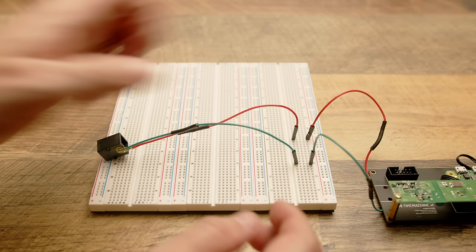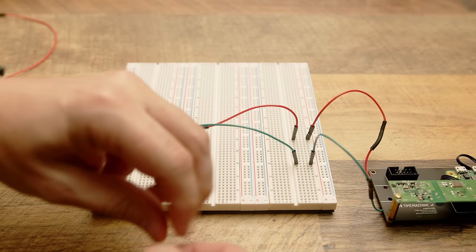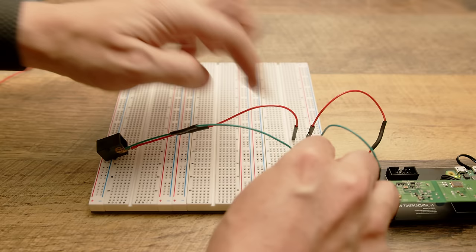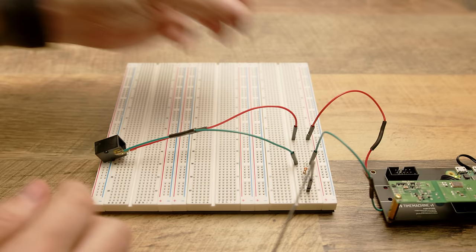If you've been around long enough and had an old phone system, you know that when the power goes out, the phone still works. This is because the telephone network actually supplies power to the lines. They do this in order to help transmit signals over long distances. Now, modems know this and detect the current on the lines to know if they're connected to a real telephone network or not. So, the only thing that we need to do in order to trick our modems is supply the right current to the lines.